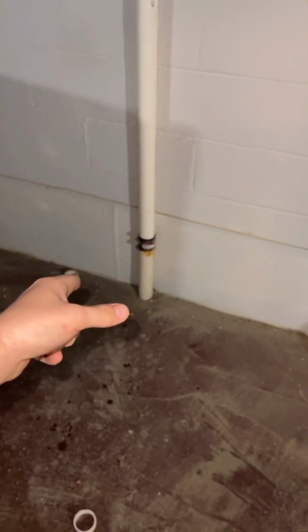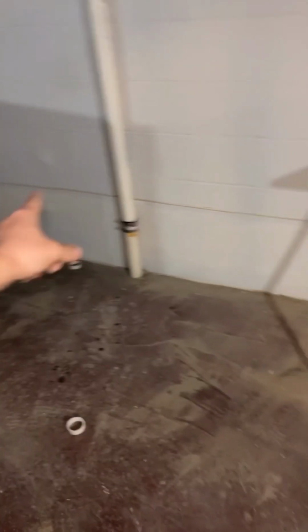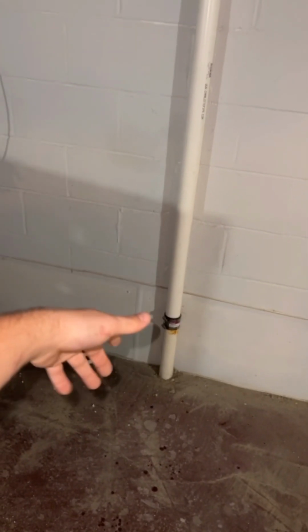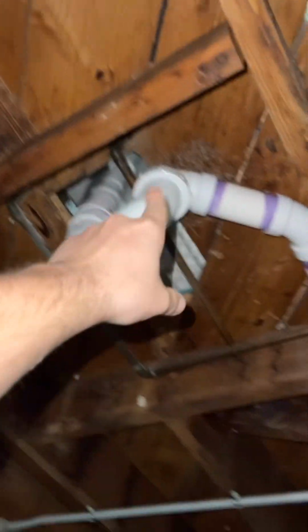So when I bought the place, they had already done a basement waterproofing at some point. I don't know where the PVC connects, but there's actually PVC coming out of the ground, which is nice, for the kitchen and the tub. And then it obviously ties in somewhere over here. I updated from where the Fernco is up. I could have put a coupling there, but I bought a Fernco because I thought what was coming out of the ground was just painted cast iron. I could coupling that, but I'll just leave the Fernco because if I ever need to, it almost functions as a clean out.